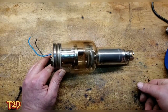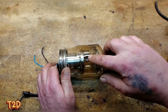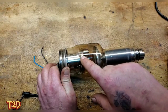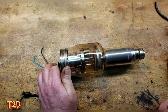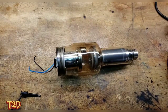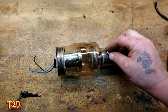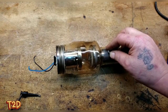Grinding the glass thin allows the tube to be used for soft tissue imaging such as mammography at lower potentials, since glass blocks quite a lot of x-rays. An interesting failure mode: after a long life, tungsten from the filament deposits on the glass and eventually becomes conductive, so at high potential you get arcing across the inside of the tube from cathode to anode - that's when a tube is nearing the end of its life.